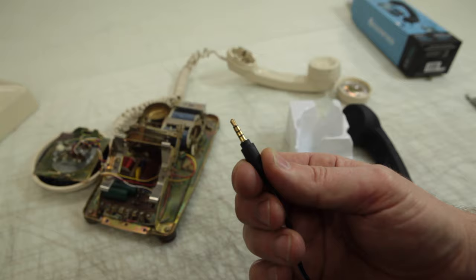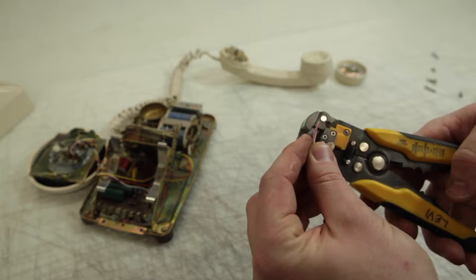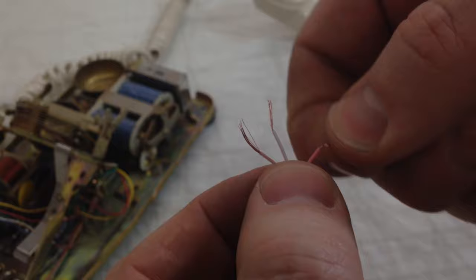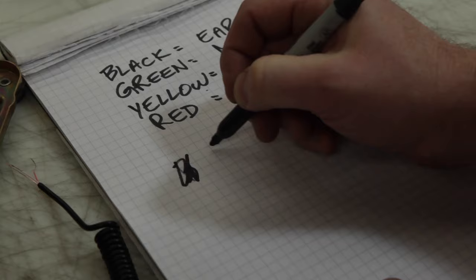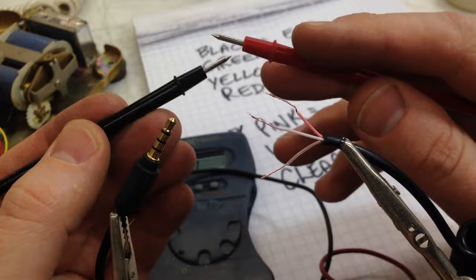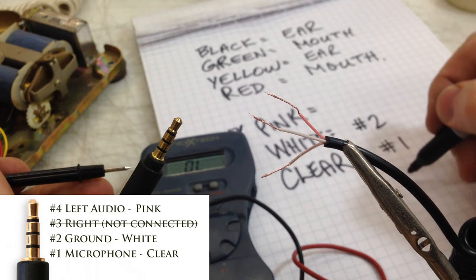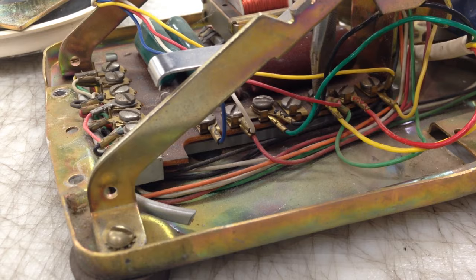The next thing I'm going to need is the cord that runs to the cell phone. This has to be a four-pole 3.5 millimeter jack, and it's not a very common cable. So I picked up a brand new discount headset for a couple of dollars and I'm going to cut the cord off it. I strip back the sheath and find there are three wires. I'll use an audible continuity tester to find out which wires are connected to the bands on the four-pole jack. Number three isn't used, which makes sense as the handset was mono. Last year I tried to use the cord off an earbud-style headset, but the wires inside were so tiny that I couldn't use it for this application.